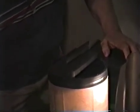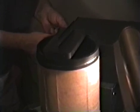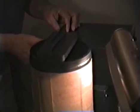See if we can get it adjusted right on the resonant frequency. Just hang on. We'll see a little emanation, wiggling when we hit it just right. Shut that down a second. I wish I could see this dial. We're getting it set up now for the right resonance range. And that's a sine wave frequency going to this inside coil.